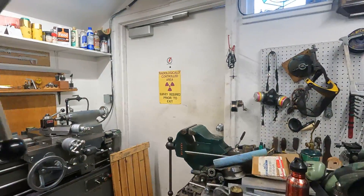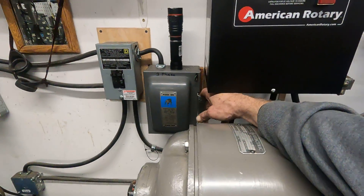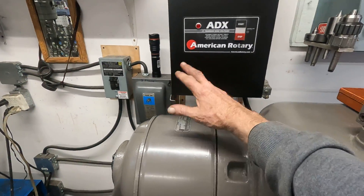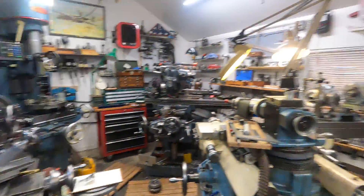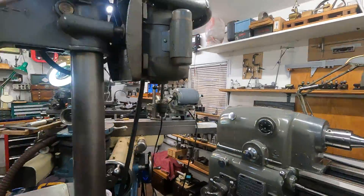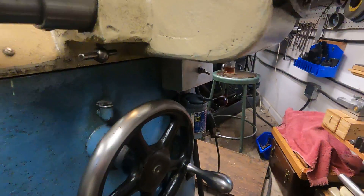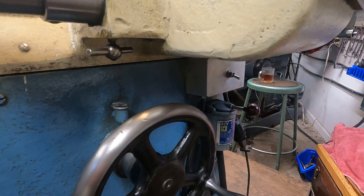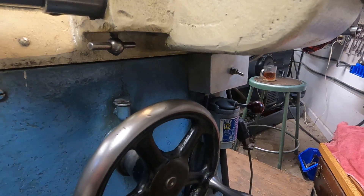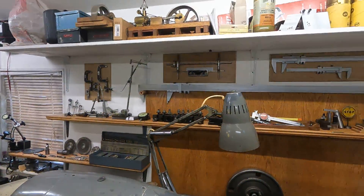Over here — that's a good unit there. It's good to shut the power off to it; otherwise if you push the buttons on the machine they'll single-phase and buzz. If you had an old-style switch like on the cutter grinder here, and the phase converter was not on, it would single-phase the motor and could possibly burn it up if it sat long enough — the motor buzzes. Anyway, I'll see you guys later.